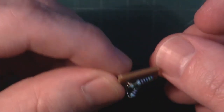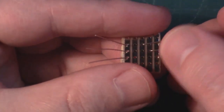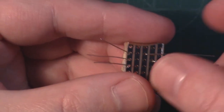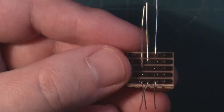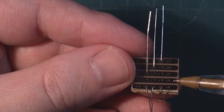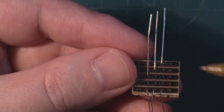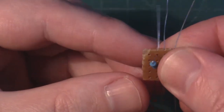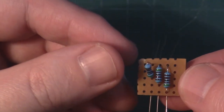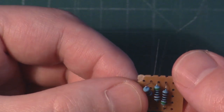but yeah. So if we flip this over, which is the way I intend to install it, and this rail here will be the 5 volt, something like this, and then we'll have our RGB, and I may remove this strip altogether or just put lacquer over it or something. But yeah, so we have our little resistors coming across and the pull up our signal to the 5 volt line. So I'm just going to solder this in place and we'll see about fitting it.